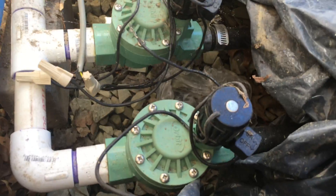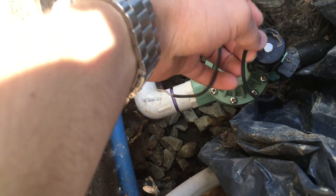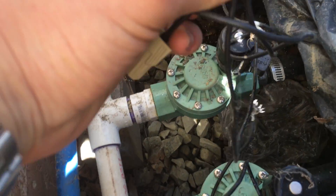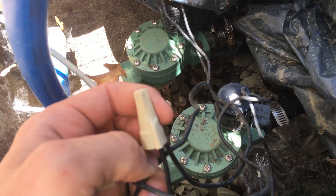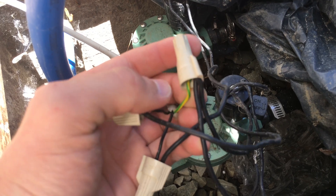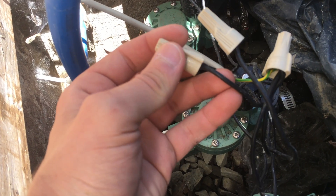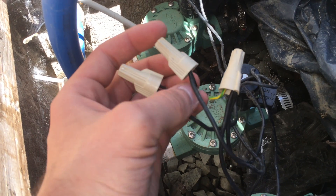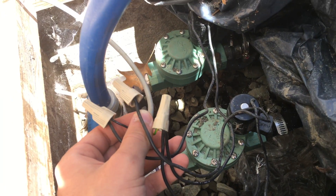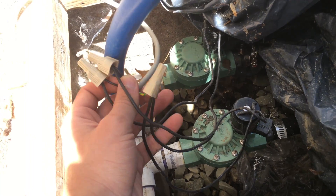So let's talk about how I have them wired. I am currently only using two valves. Of the valves I am using I have taken one lead from each of them and connected them together along with a yellow wire from a grey 3-conductor wire. Then I took each remaining lead from each valve and connected them to their own lead on the grey 3-conductor wire. This means on the grey 3-conductor wire there is one common and two individual. The way I wired it just makes it use less wire because I only used 3 wires instead of 4, but it is not the only way to wire it.